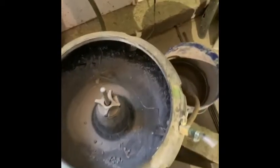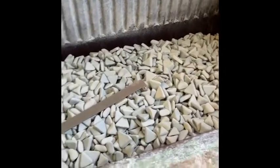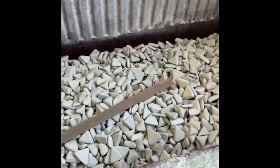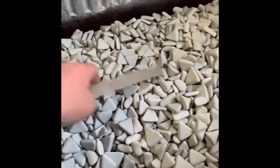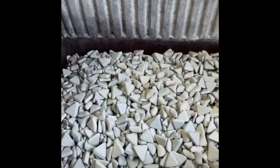That's why we're building the three-gallon one. We do have a bigger one — this is a three cubic foot tumbler. Can you imagine trying to find all the parts in there? There's probably 200 to 250 pounds of media in there, and it's kind of a pain to find your parts. I do a lot of mild steel parts in here, and if you put stainless in with them it turns them all black.